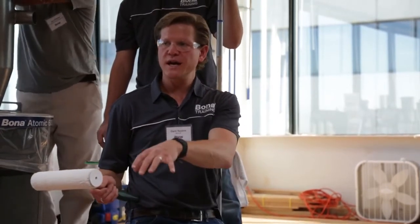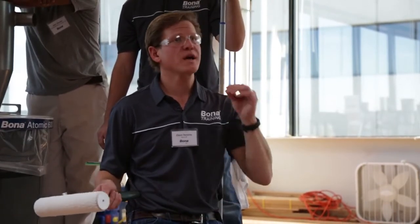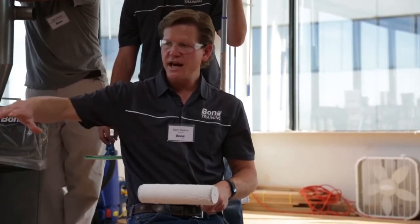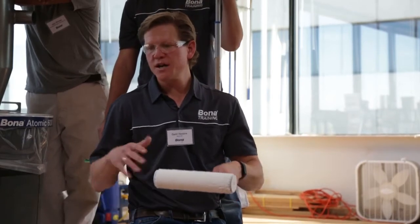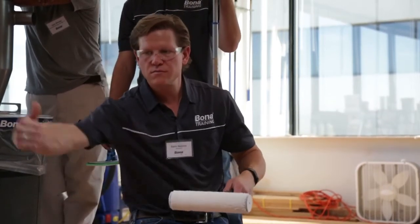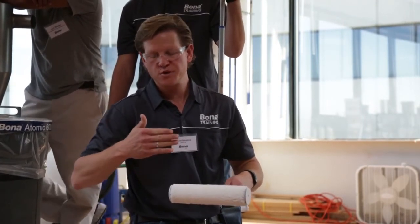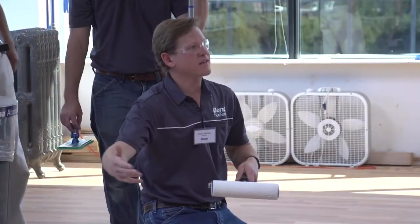In this case, we had 2 coats of sealer and a coat of finish, so we have a nice, solid, smooth build layer. So we're able to actually work that cross grain. If we had a medallion, herringbone, or any sort of pattern, I'm not really too concerned about the direction that I'm going, because I know it's not pulling and, for lack of a better term, streaking like a T-bar would. It's just laying that finish out. So direction doesn't really matter.